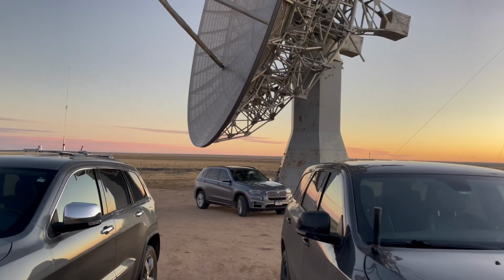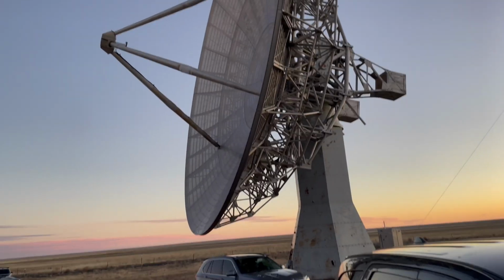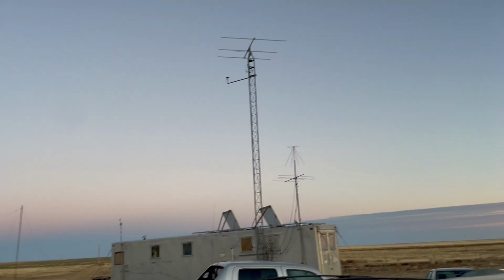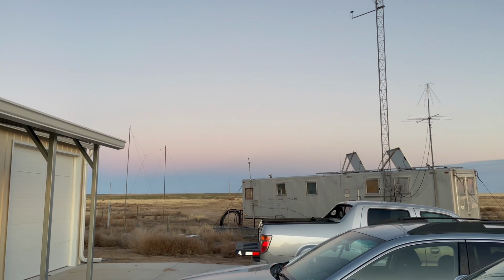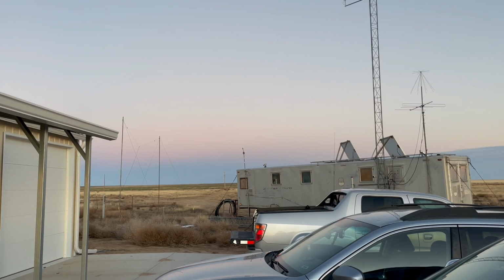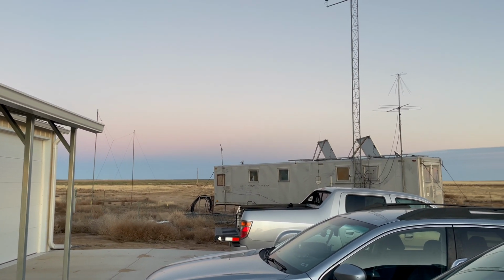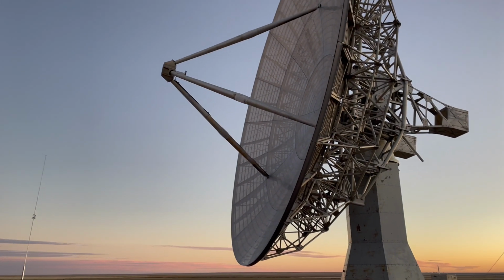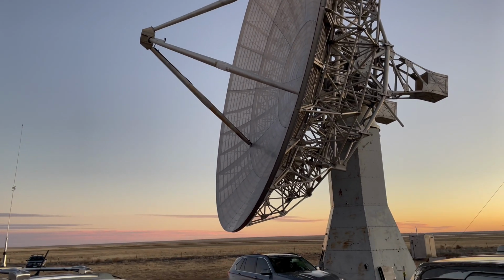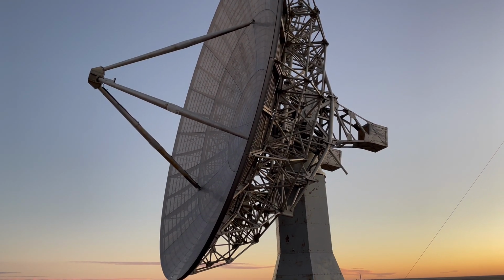So you saw the elevation and azimuth right there. And so you see we now have the radio telescope pointed at about 69 degrees, I think it was, and about 9 degrees elevation up from zero. And so yesterday we picked the moon up at about maybe 2 degrees past the horizon. And so right now it's sitting at 9 degrees, so you can see it's tilted just a little bit up. But we are ready to go about another 25 minutes, and then we should be back on the air, Earth, Moon, Earth, at the Plishner radio telescope.